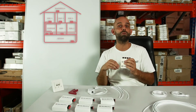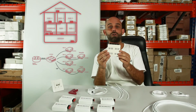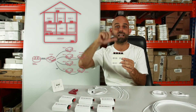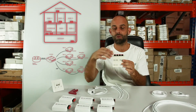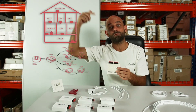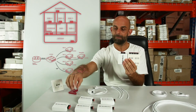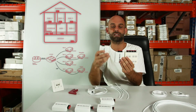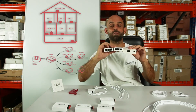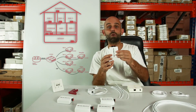Now the last installation — the most pro — which would be a mix of all the previous ones. For example, an installation that combines STAR with DAISY chain using the ACT-2003. Here we're talking about homes with multiple problems in different rooms and multiple stories. The installation begins with the STAR setup, with our switch connected to our router to reach those rooms with problems by cabling with plastic optical fiber, achieving one gigabit per second in all rooms. We place ACT-1003 as a receiver. Perhaps in a room where we need to reach a third space, we connect a DAISY chain using an ACT-2003 — going from the switch with fiber optics to that point, and from there reaching a third location with the plastic fiber optic port, with Ethernet connections at each point.